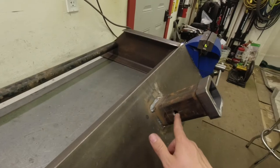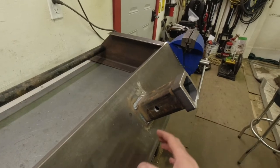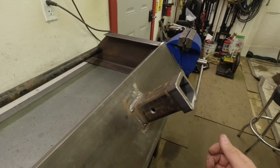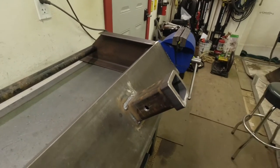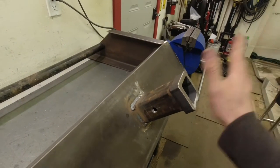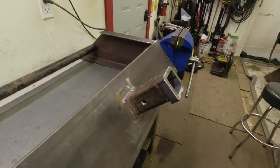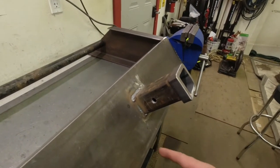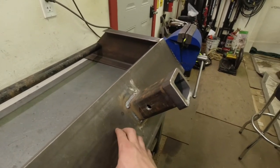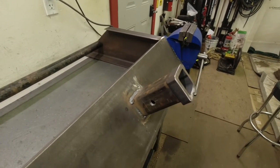Your hitch will go in, hitch pin goes through, and you'll be able to use whatever kind of hitch you want. A lot of people have a pintle hitch. I thought it was maybe better if you had a hitch like this. You can pull grain augers around. You can pull your car hauler trailer if you wanted. You can pull any kind of other trailer, as well as you can put the pintle hitch receiver in here. They're good for 20,000 pounds, so you'd be able to pull any implement you want home as well. If you wanted to pull a pup with this truck for a grain box, you probably would want an actual pintle style bolted onto a plate, because those are good for quite a bit more tons than this is.